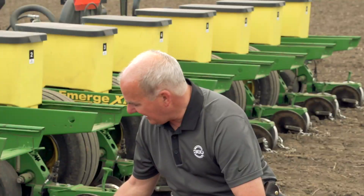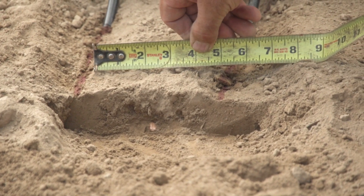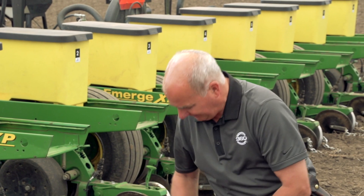In this case, the 360 Bandit has a disc on each side — we're three inches over to the side of the seed. Because of dryness in this plot, we're two inches deep here today and we're planting 34,800 seeds, so about every five inches we have a seed. The bandit is putting the nitrogen only three quarters of an inch under the ground.